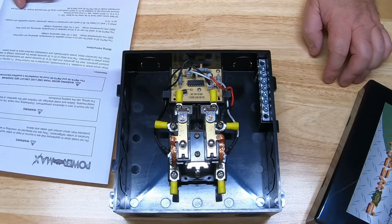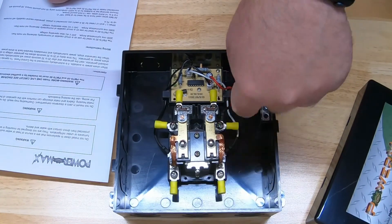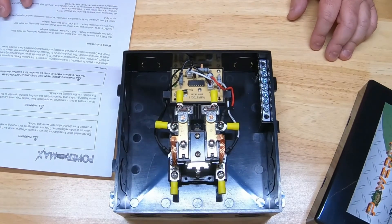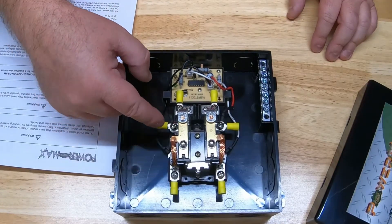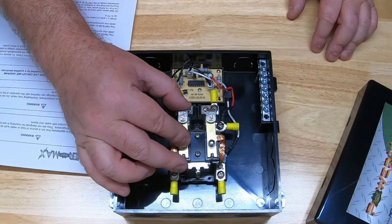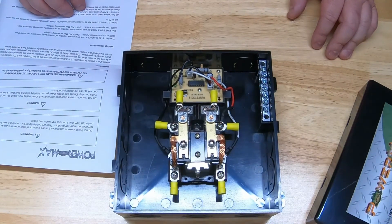At the back, these are the outgoing lines that go out to the wiring panel. I'm going to set this up tomorrow when I'm back on the boat. We've got connectors over here that are the earth connectors, so all the earths will be terminated there. I've got a lot of spare wire from last year's anchor wire install, which I'll use for any connections I need to make. As you can see, the lives are all on one side and the neutrals on the other — it disconnects the entire thing, not just one side, which is what's required.